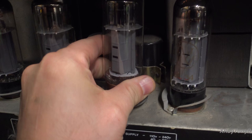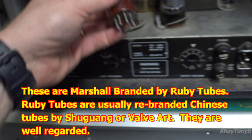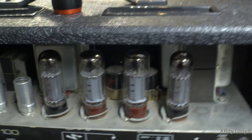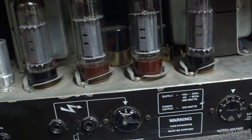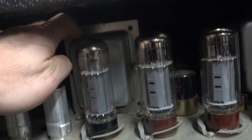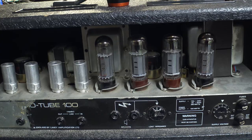Let's pop one of these out and see. These are a set of Marshall EL34s — how about that? So we have some mismatched output tubes. Some of the later circuits on these amps have auto tube matching — if you have mismatched tubes it'll auto-adjust the bias. I don't see any bias spots on the outside, but that doesn't mean this amp isn't fixed bias. There are great big transformers, a huge choke coil — quite a few interesting things here.